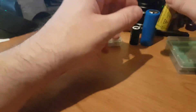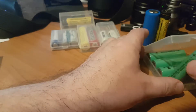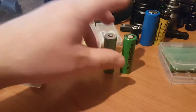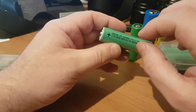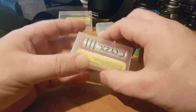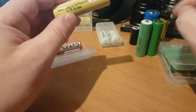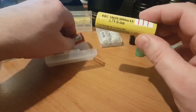Jumping over to lithium-ion batteries — 3.6 to 3.7 volts, various sizes, particularly the 18650. They'll refer to the capacity of the battery somewhere on them. These particular ones are 2,500 milliamp hours, which is the power capacity held within the battery. The UK market and eBay in particular is flooded with batteries claiming wildly inflated capacities — this Samsung one is 2,500 mAh.